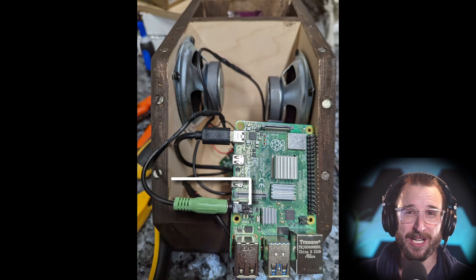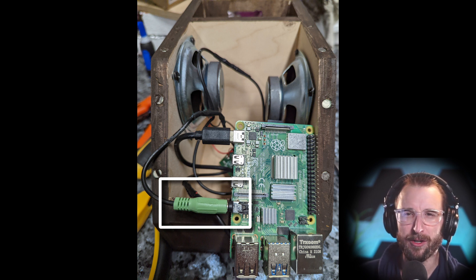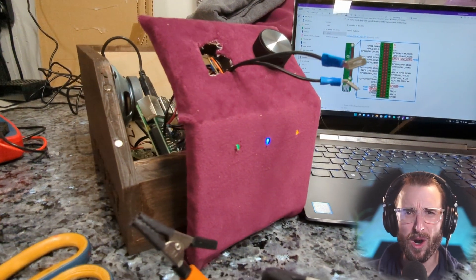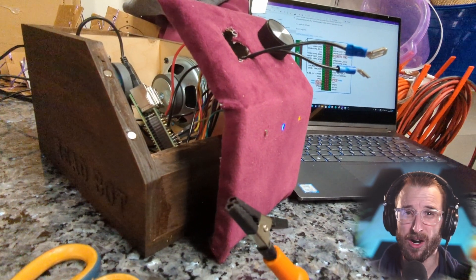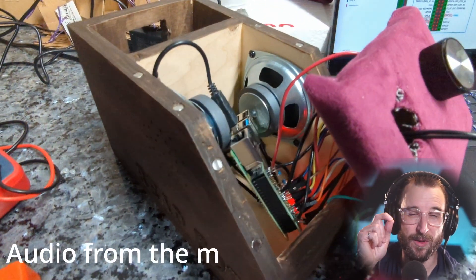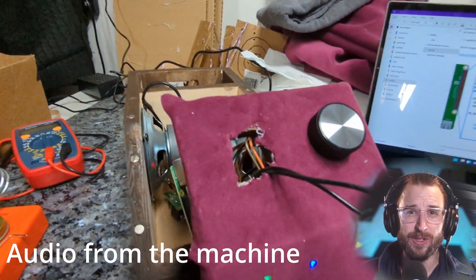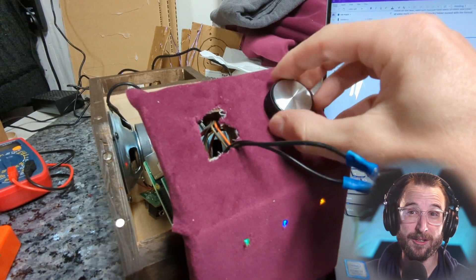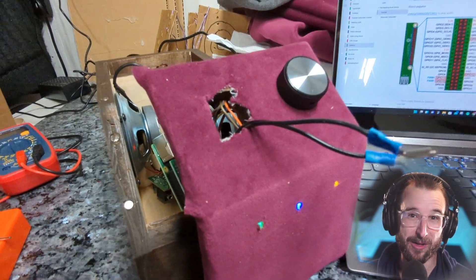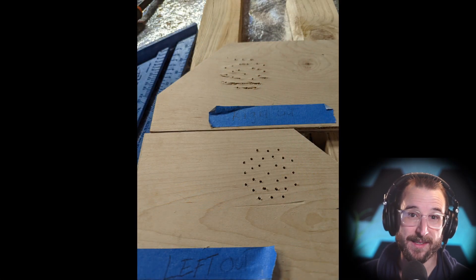The tight fit is mostly because I forgot to account for the 3.5mm plastic connector adding about one inch, so the Raspberry Pi sits at an angle inside the box. The Raspberry Pi also requires a proper shutdown via a button — pulling the power cable is not recommended. Part of me thinks that for a production-ready device, it would be better to use a microcontroller like Arduino. However, in my situation, the conveniences of the Raspberry Pi outweigh that disadvantage.